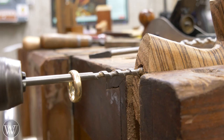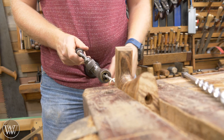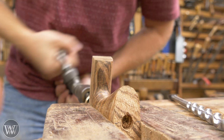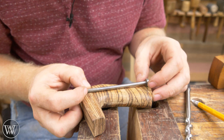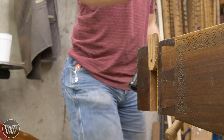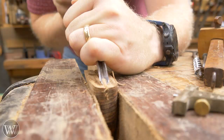We're going to cut that slightly larger hole first and create a little recess for the head of the bolt to sit in. Then we come in with the quarter-inch bit and bore this through. This is where I want it to be perfectly level — I have it clamped in the vise level with that line. Then I can put the ring on there and check it. A lot of people will ask why didn't you drill it before doing all this work — the problem with that is when you're using hand tools, it doesn't matter if you drill it before, during, or after; you're still going to have to do the same method to drill. I like to do it after all the shaping because then it makes it much easier to see exactly where the hole needs to be. If you drill from one side and then drill from the other, the two meet in the middle — it's very easy to do. If you have a drill press it's easier to keep the hole squared to one of the outside faces, but if you don't, just eyeball it — it's really simple.